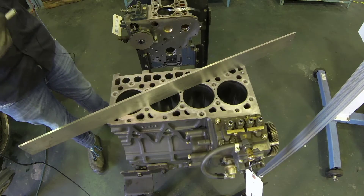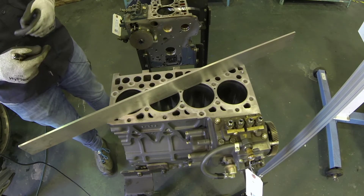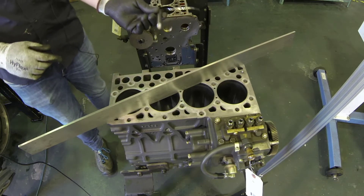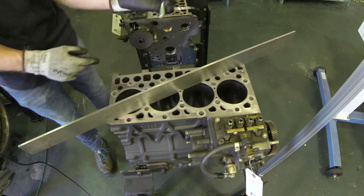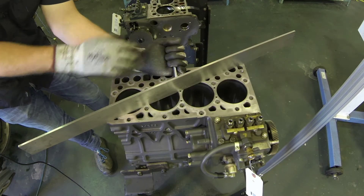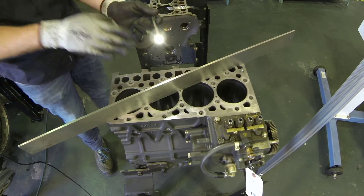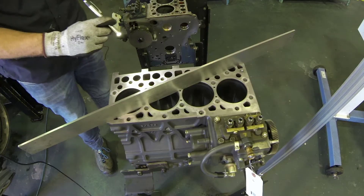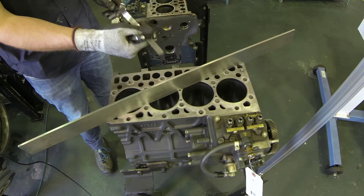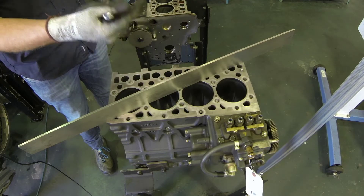Initially and very quickly, if you were just doing this in the shop, you wouldn't necessarily need to get your feeler blade right away. You use a feeler blade to compare against the manufacturer's spec. What we know is that if we can get light through between the straight edge where it makes contact with the block, then we have some warpage. Light will go through a much smaller crack than we could even get with the smallest feeler blade — this small feeler blade is one and a half thousandths of an inch, 0.038 of a millimeter. It is very, very small.